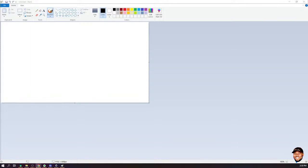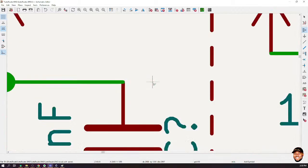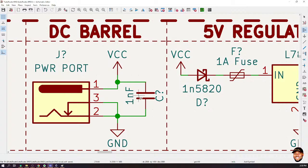Okay, so you remember the values you are mentioning, right? We fortunately don't have any of those in what we are doing. Our power is coming from the DC source, and we are trusting the DC source to do that job for us. Now, what we are in any way checking is some light filtering. If you look on the barrel, you can see that there is this small capacitor over here. Now, about ferrite beads, personally, I don't like to use ferrite beads in my work. What I've realized is that if you are able to properly lay out your boards, you don't actually need ferrite beads.